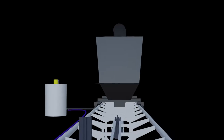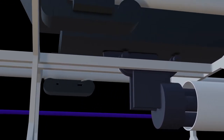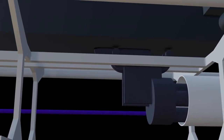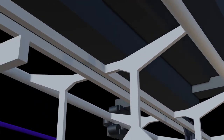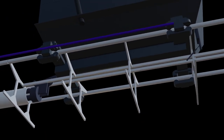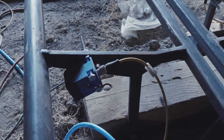That brings us into the second half of our system, which is the energy release system. A really big part of this is communication. Once the cart is going down the track and it reaches the launch bay, it passes over the launch rod, which has a spring-loaded mechanism, and then hits an emergency brake stop, essentially sandwiching the cart between the launch rod and the e-stop, making sure that it marries perfectly with the rod. In that location, the wheel assembly hits a sensor, which tells the PLC, hey, I'm here, I'm ready to go. As soon as that happens, a countdown initiates in the PLC. We'll say 30 seconds. At 30 seconds, the launch sequence will be initiated.